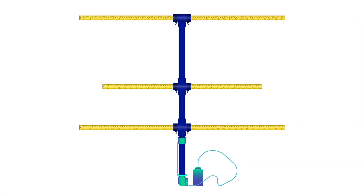Some directional 2-meter antennas have up to 28 elements. Many hams have success with 2-meter Yagis they make from old tape measures and PVC pipe — it's a quick and easy project. If you're far away from a repeater or looking to do things like communicating with satellites or the ISS, it's time to evaluate different directional or Yagi-style antennas. Yagi antennas are popular on HF to help bring in the DX signals from around the world. The biggest trade-off with a Yagi: if it's not pointing at a signal, it's much harder to hear it and talk to that station.